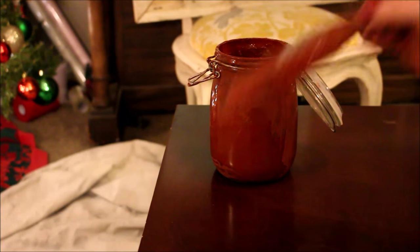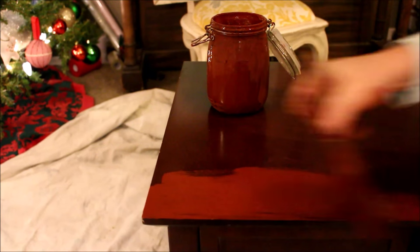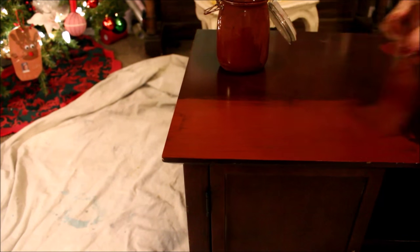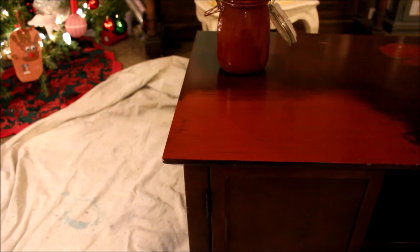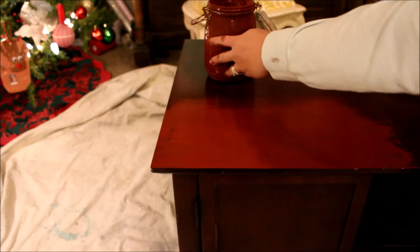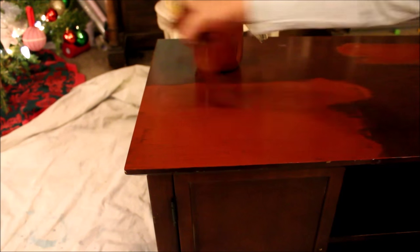Sweet Pickens Milk Paint takes one to three coats. It's important to do nice long even strokes and there shouldn't be any clumps when you're brushing. If you notice clumps as you're brushing, you need to mix it some more. The other reason I like to wait for it to thicken up is it also gets rid of all the frothy bubbles that happen when you shake your milk paint. I'm going to go ahead and get my first coat on and then I'll show you how it looks.